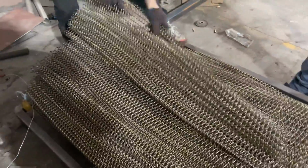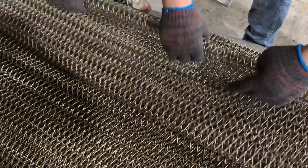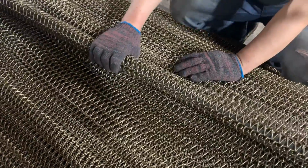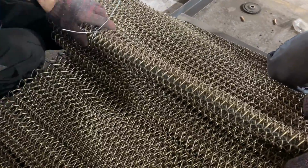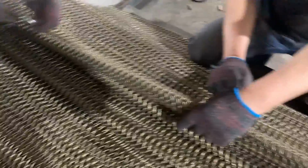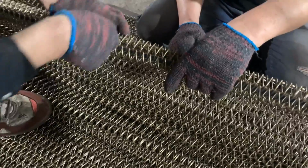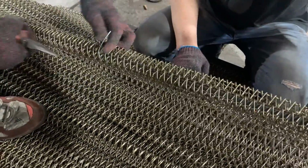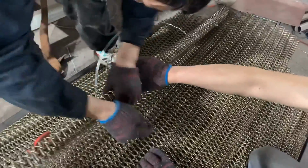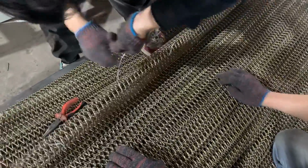At the outlet of the cooling zone, we first find one end of the chain, wrap this end with a short steel bar, and fix it with steel wire ropes. You can make a pull ring with steel wire rope to pull the whole train easily.